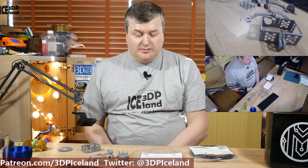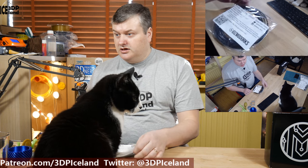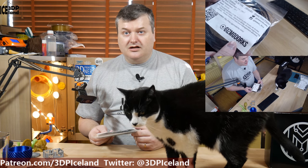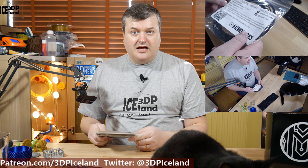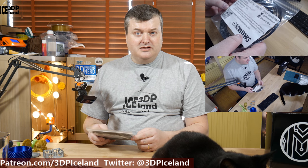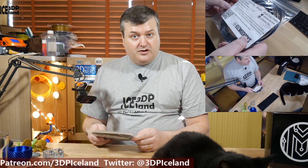The second filament I'm going to talk about is a POM acetal filament from Gizmodorks. This is a special material called Acetron — it should be an extremely strong and durable engineering polymer. I was absolutely unable to print anything with it. Whatever I did, I had no means of getting any better adhesion. I tried out absolutely everything the internet suggested, and even the information I found on their website didn't work on my printer. I had the heated bed at 110 degrees.